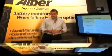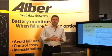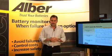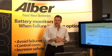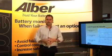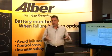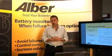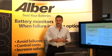Capacity in general is not something that can be done any other way to achieve a true capacity value. There are a lot of other mechanisms or test methods in the field that allow you to take state of health measurements, and one of the most popular ones now are ohmic measurements, which have developed popularity over the last 10 or 12 years.